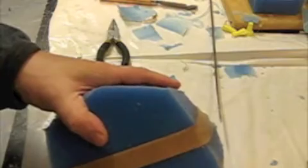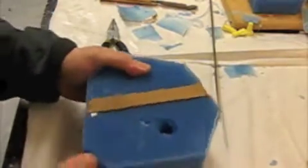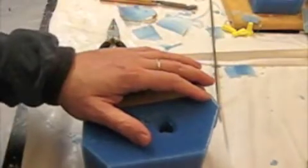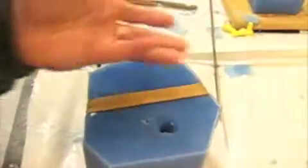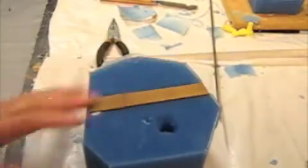And then what we'll do is we'll do an initial pour, and we'll study the mold from there. If it needs to be doctored anymore, any more air tracks need to be done, depending on how the casting comes out. But I'm anticipating that it should be fairly good. Well, that's it. Now you know how to separate a 2-part mold, how to separate a 1-part mold, and the next step, in the next video, is to do a little casting to see how that goes. Okay.